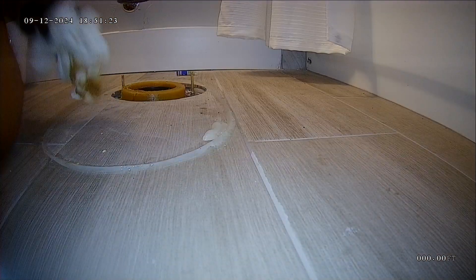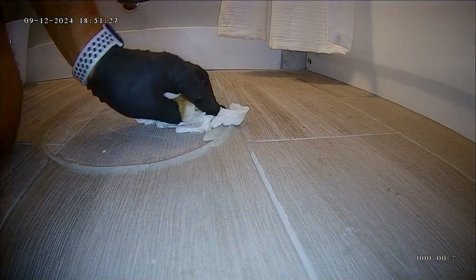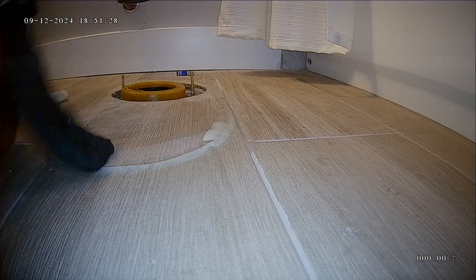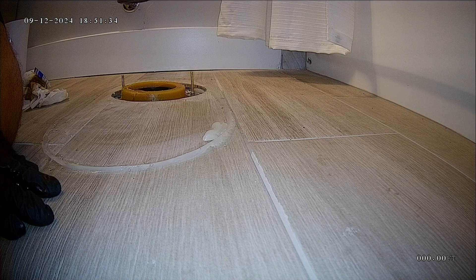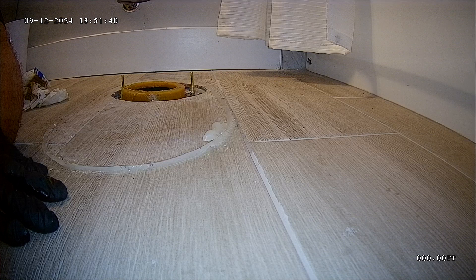The cast iron looks pretty poor. It's hard to say how bad it is and how much would come off with cleaning. But at a minimum, you want to have it cleaned and then reevaluate while you're still in your due diligence period — that way, if there's a bigger issue, you still have the possibility to negotiate with the seller. In either case, I would also recommend having insurance on this line unless you fully replace it. If you have any original pipe left, I'd recommend having the insurance.